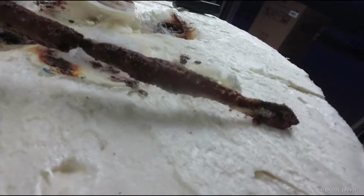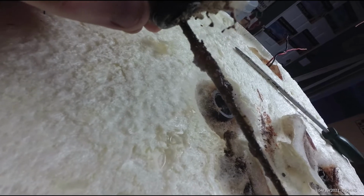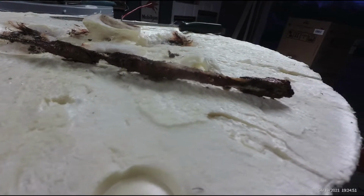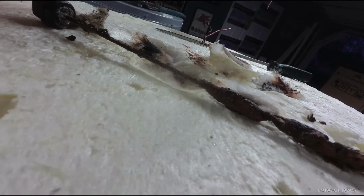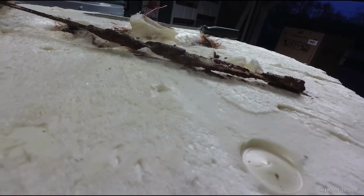This thing has just dissolved, and it's a combination of hard water, heating water, and just something that was never designed to last in the first place. They make them out of aluminum. This one's probably aluminum. They make them out of magnesium, which I think lasts a little longer than aluminum. They're just designed to give up electrons, give the minerals something to attach to rather than eat away at your tank. But this one is just done.